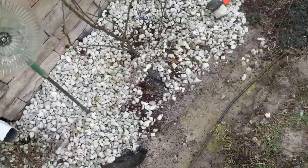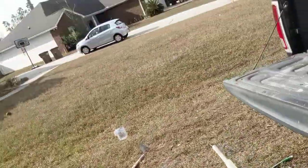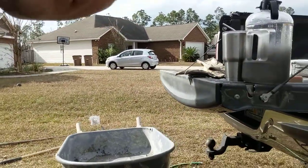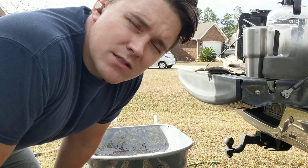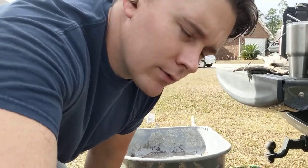I take a little bit of concrete and lift up the rebar just so you don't have to mess with it — just keep going. I got the Pro Finish 5000; it's got a little bit more tensile strength to it. Some people say to do the sand mix or the sand topper, but I wanted the rock in there for a little bit of strength.